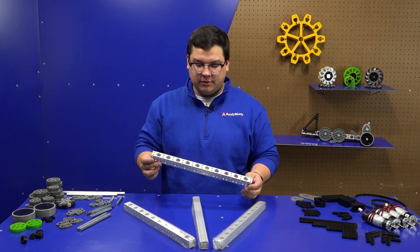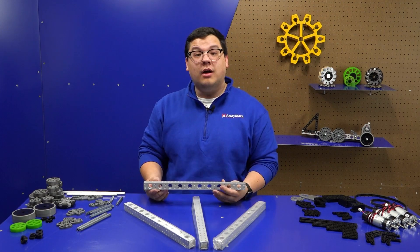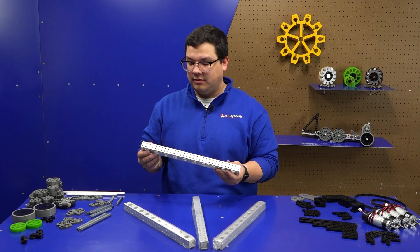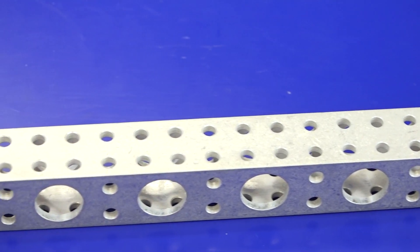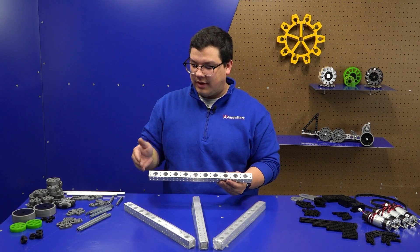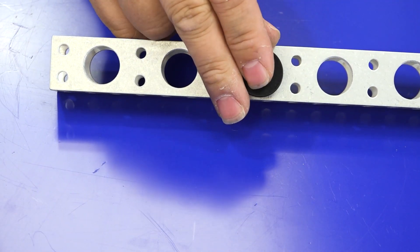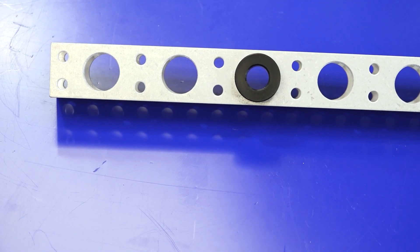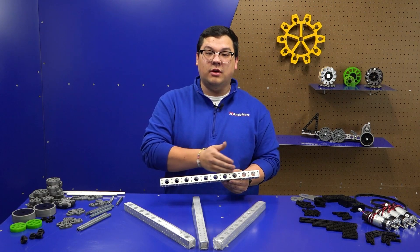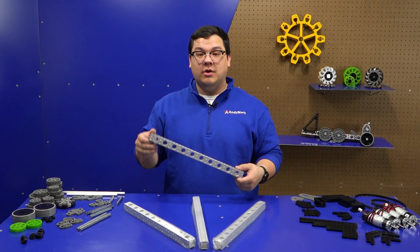At the core of Robits is our tubes. This particular tube is our 1x1x15.5-inch long tube. Along the top side of our tube is a series of number 10 holes on a half-by-half grid, allowing you to easily mount gussets and components to the top of a tube. Additionally, on the side of a tube, we have a series of half-inch spaced holes for a number 10, and in between each of those is a larger hole designed specifically to fit a bushing. Tubes are really great for mechanisms because they allow you to transfer motion along the length of the component, and are awesome for things such as drivetrains, arms, or even upper structure.